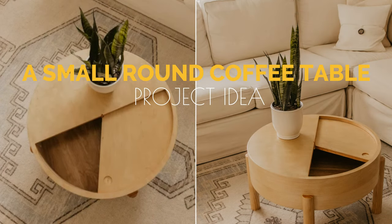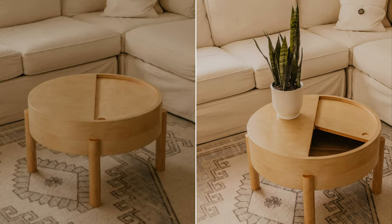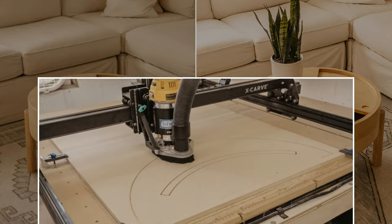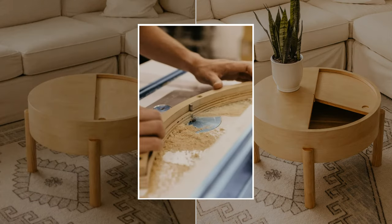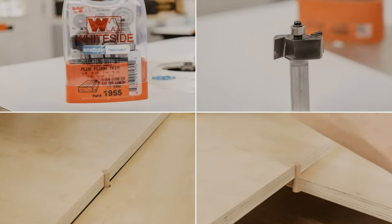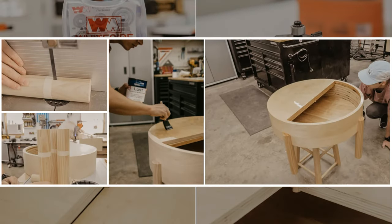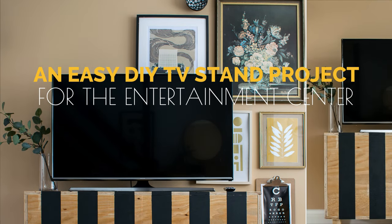Number 8: a small round coffee table project idea. A sliding top feature for a coffee table is an exciting idea — you could open it to hidden storage and close it to function as regular furniture. Begin by making a template using X-Carve, trace the template for the base, and cut them into pieces, then flush-trim the pieces. Repeat the steps for the top and bottom pieces. Make a rabbet in the base and create a pivot point to keep the sliding top on track. Add veneer using contact cement, sand the surface, make the legs, and apply the finishing.